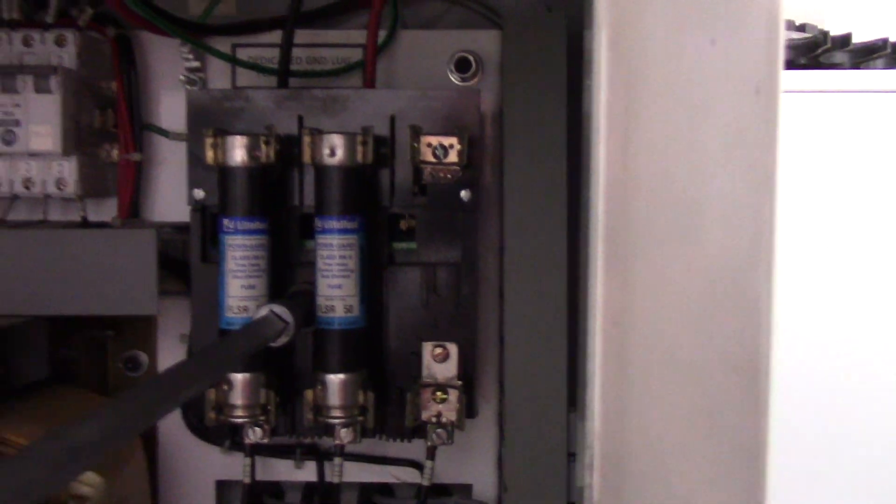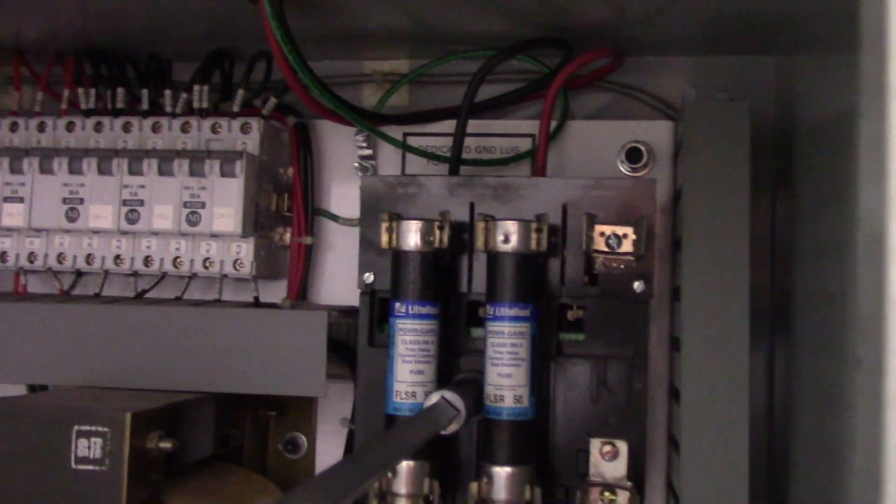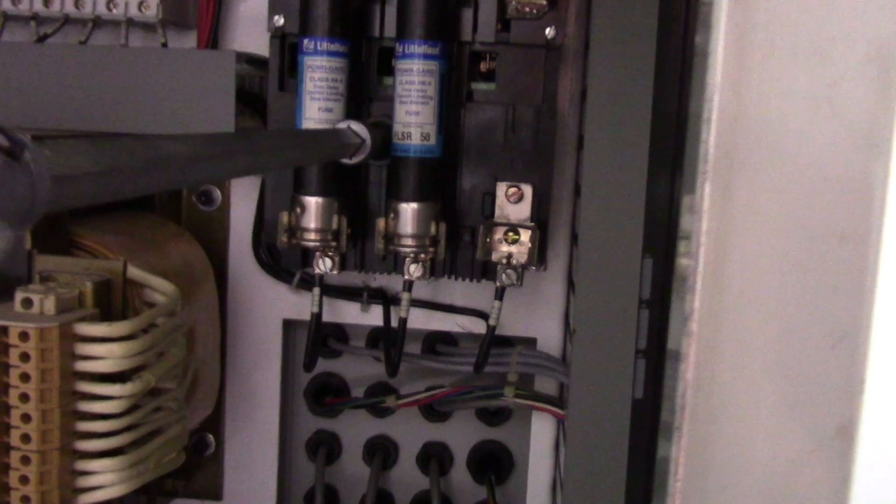It does have a coolant pump. It's single phase. Here's the inside of the cabinet — this Yaskawa spindle drive will run single phase, and it is currently running single phase in my shop. You'll see I've got a jumper over there so it'll run single phase. It's 220 single phase and I have it on a 30 amp circuit. This will run in a shop.